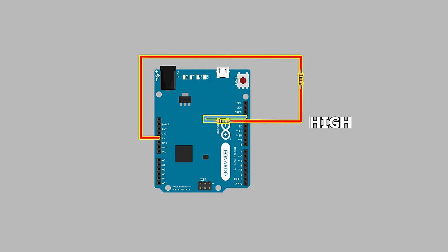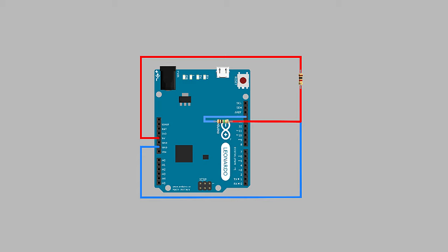If the wire between the smaller resistor and input pin is now connected directly to the microcontroller's ground line, which is at 0 volts, current will not flow through the large resistor, instead flowing only through the small resistor directly to ground because the total resistance of this path is less. Because of its direct connection to ground, the pin voltage is now also at 0 volts, and the microcontroller will return that the pin value is low. When the button is not pressed and the connection is open, the voltage on the input pin is close to 5 volts. When the button is pressed and the connection is closed, the voltage on the input pin drops to zero. Once the button is released, the connection is broken and the voltage is pulled back up to near 5 volts.